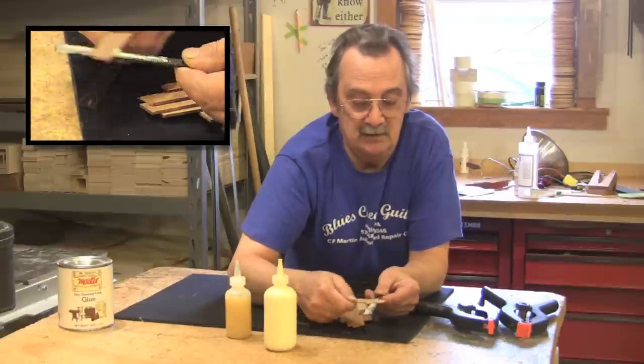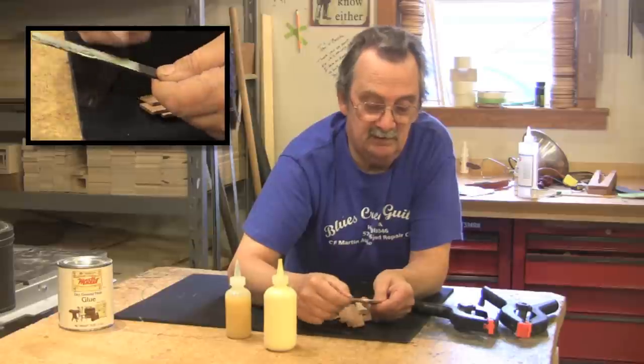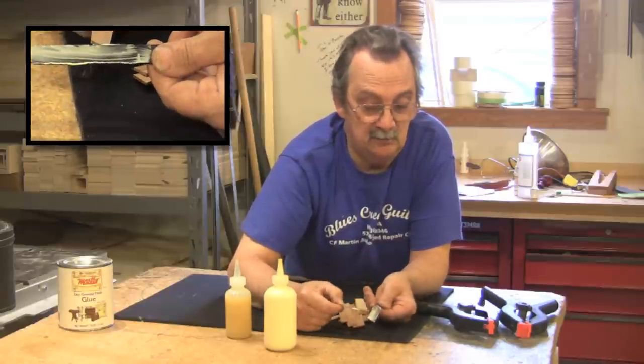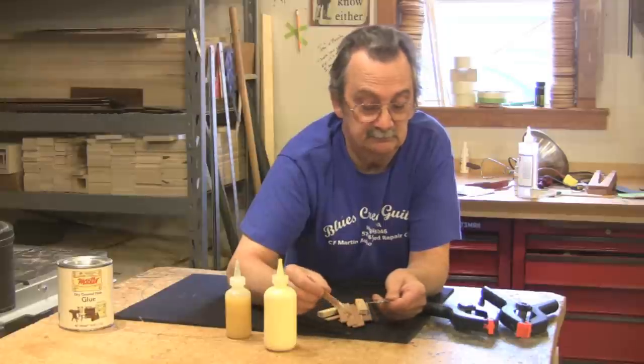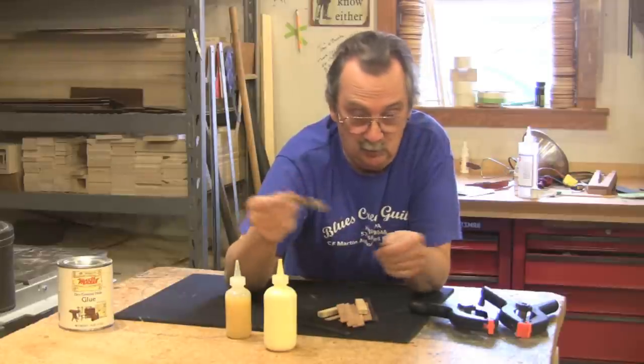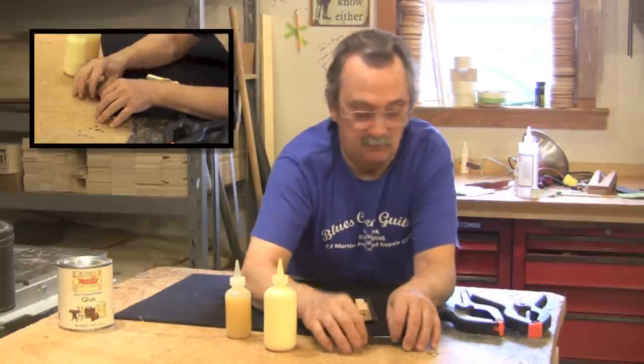But can you see, I have a nice thin film of glue. You can see the glue there, but you can also see the wood. All right? For the best results in gluing, you actually want to put a little glue on both surfaces. Then, when you actually clamp it,